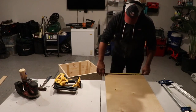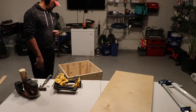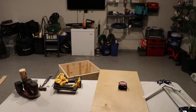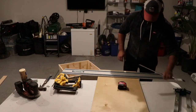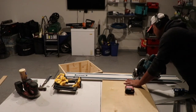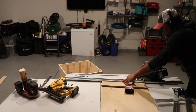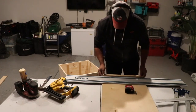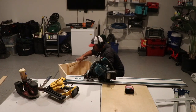I'm going to put some side braces in there and cut this three-quarter-inch plywood — also some scrap I had, so factor that into cost if you need that material. The platform's top ends up being 10 inches above the ground. I just used my little square as a guide for the size of those little blocks — no rhyme or reason, they're just holding the platform. I ended up standing inside of this box and it's plenty strong — holding my 250-pound self — so not worried about our little Christmas tree.